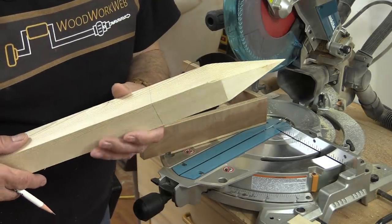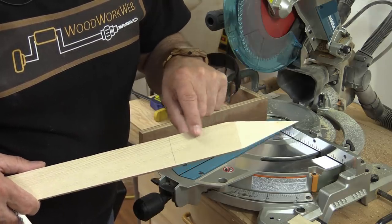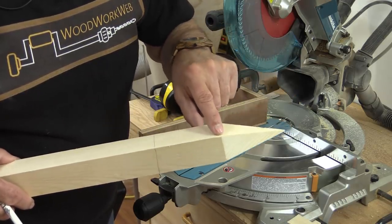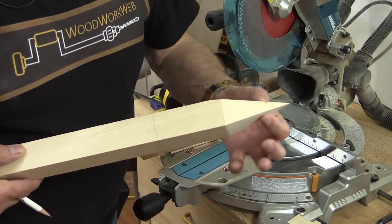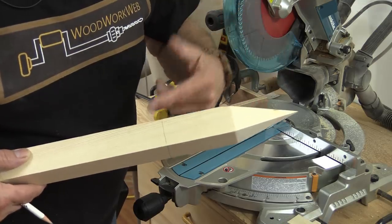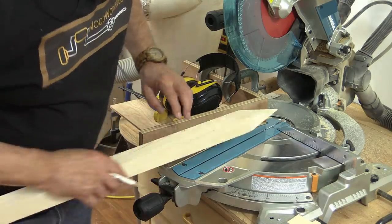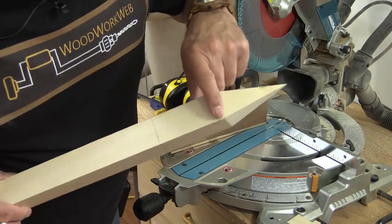Now you can see that my alignment is off a tiny bit. You can see two different shades of wood there compared to that side there. And in an ideal world, you can see they would all be perfect. And there's two of them that are perfect. That's probably because I was able to follow that tip a little more precisely. Now, if this was a stake that you're driving into the ground, it wouldn't matter. But if this was the top of something, maybe a chair that you were putting some fine edges on, a peak on or something, you would want that to line up. And of course, the ideal way of doing that would be to make some lines using your square all the way around and then making an adjacent line on your jig, and then you'd just be able to follow that line every time and you would get a perfect alignment like those.